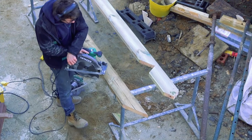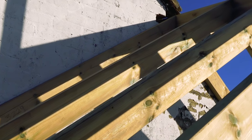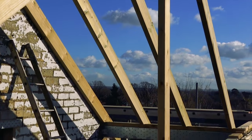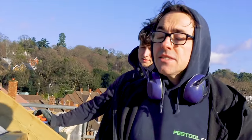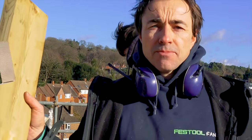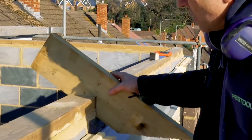Not such a problem on this, but when you've got a six-meter rafter run it saves you a few steps. Now that looks like the easy bit done, but it had to match in with the existing roof so that the tiles could run through in one straight line. So all this is is a template of the bird's mouth — the bird's mouth is a term we use for that cut.